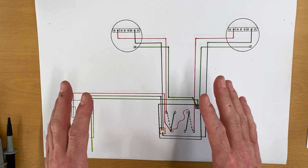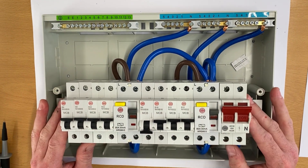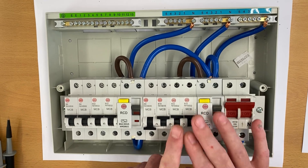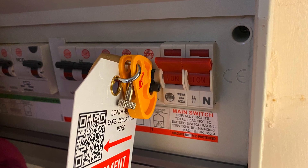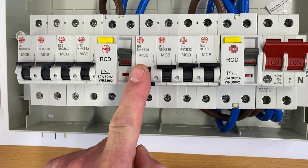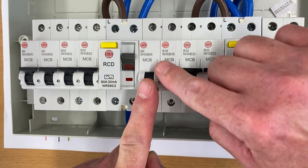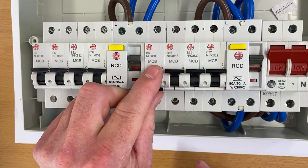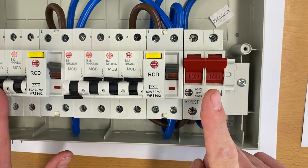I've used old cable colours because the video also had old cable colours: line is red, neutral is black, and the green-and-yellow conductor is our CPC. So that's our wiring diagram. There were some differences between doing the safe isolation procedure in a controlled college environment and how it was done in the installation. We had everything on in the installation bar one circuit — the breaker was in a slightly different position — but we had a 6-amp circuit breaker for the downstairs lighting turned off and locked off.